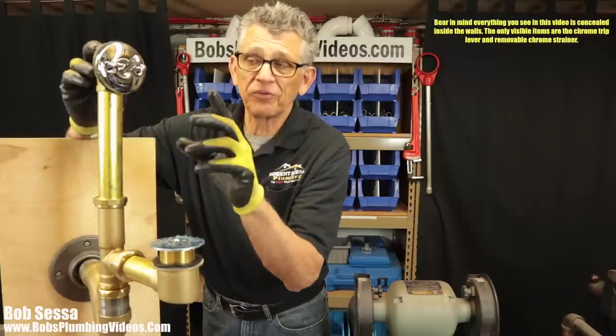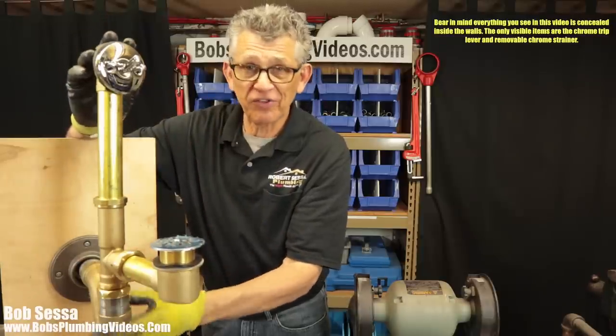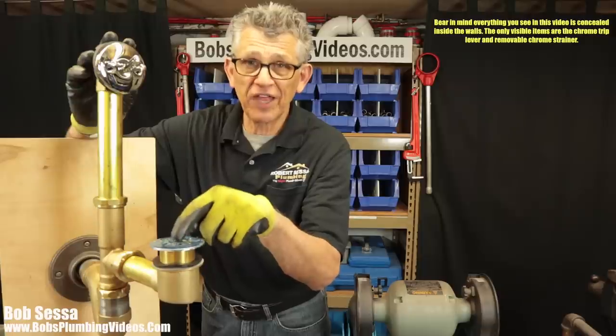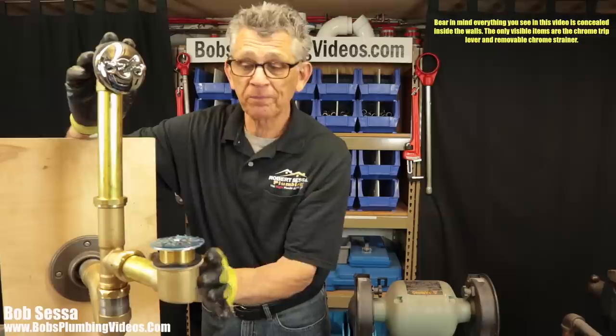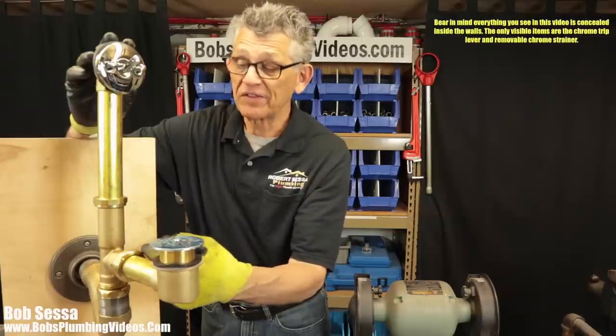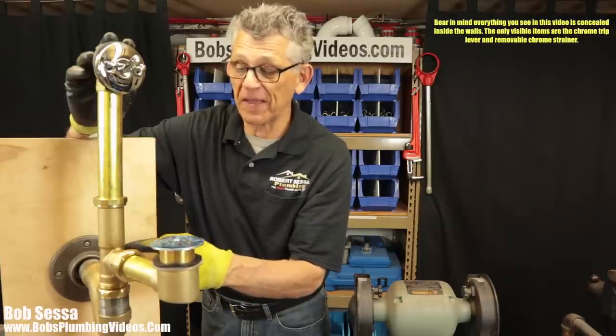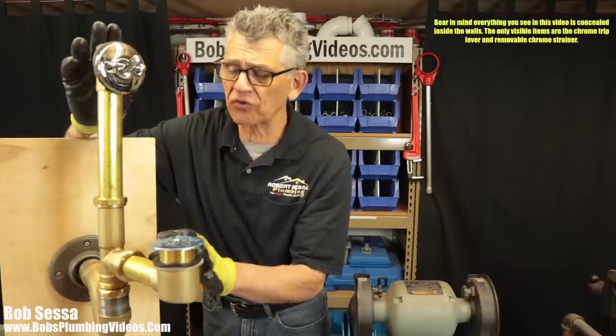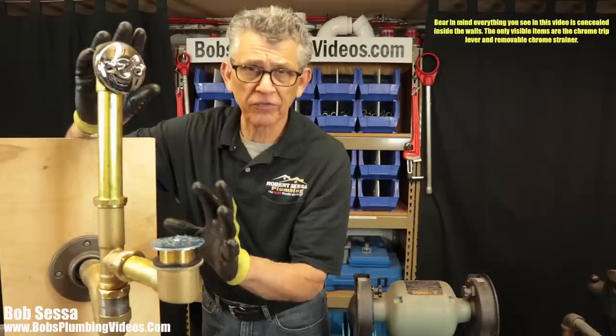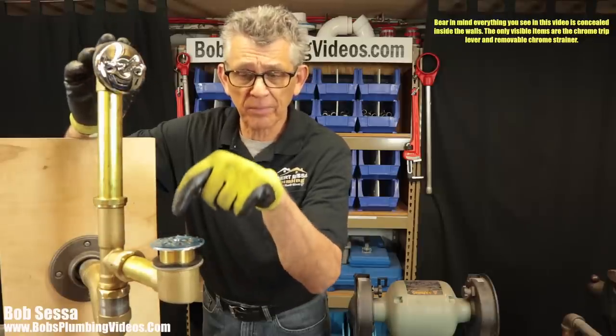And let me just back up a second. When you have to clear a stoppage out of a tub, you don't introduce the snake through here, because then it's got to go through what we call the shoe, and it would have to go to the T, make the sharp turn, and then bend and then go into the trap. It's just too many turns, too many tight turns. You're gonna be in for a world of trouble if you try to put it in from here.